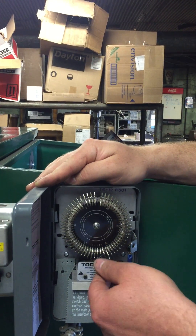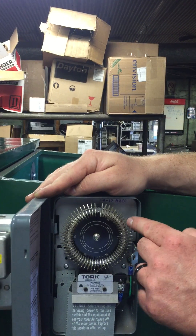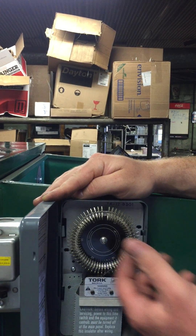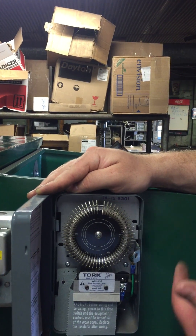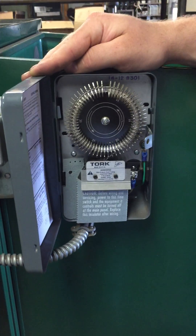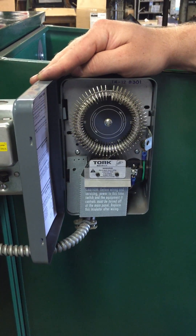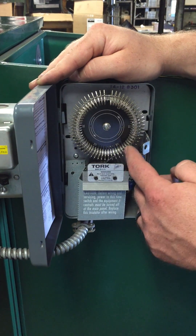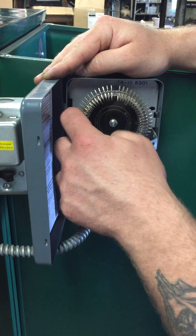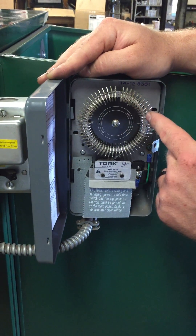Some applications you may need to space them out a little bit where you're going to have three pins flipped out — say, one at zero and one at 10 and one at 20 — evenly spaced out depending on the application: how much coal you're burning, what type of coal you're burning, the push of the coal. But factory, we always run them at zero and 15 for 30 seconds, so you'll have one down at 30 and one down at zero.